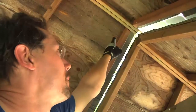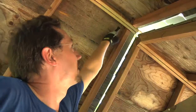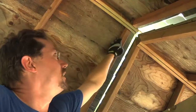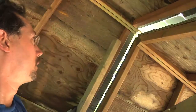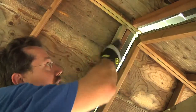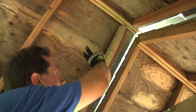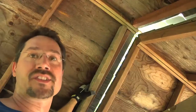I put in the center mount from the outside of the roof and I've got three screws going through that mount from the backside — they come out here, here, and here — which unfortunately isn't on that roof support, it's right next to it. So I already got a rip cut and I'm going to sister that, put it right up here, so I can put screws through this way. I'll cut the 45 on both ends, back those screws out, slap that up there, put those screws in, and then run the screws from that outside bracket back down so it'll be nice and solid.